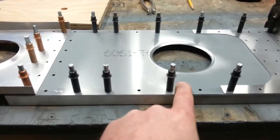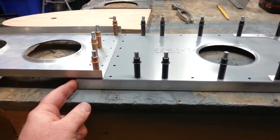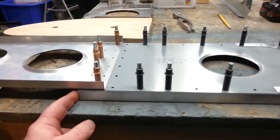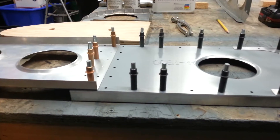So I had to make a piece of webbing. I also changed out my spar caps to structural three-quarter by three-quarter, 6061 angle — same size, just a little heavier, a little stronger.